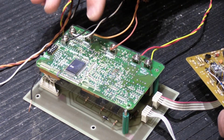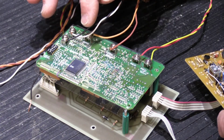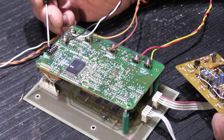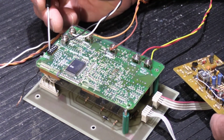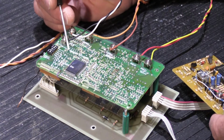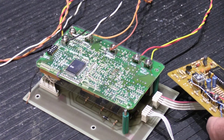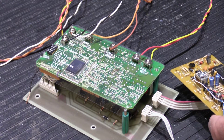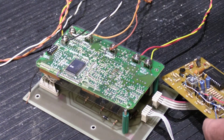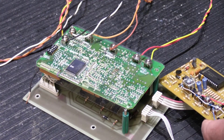system. Now, since the 5006 is a selective call system, every single remote station has an identification number, and you use these little dip switches right here to set the code for each individual station. So you would give this station an identification number. It was recommended back in the day to make it the last station in the list. So if you had 12 remote speakers, this would be 13. If you had 23 remote stations, this would be 24. 24 was the maximum that you could have.